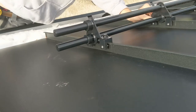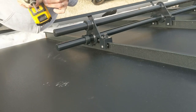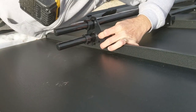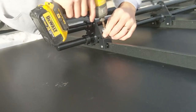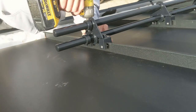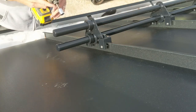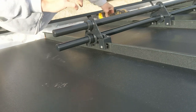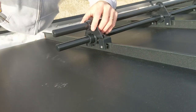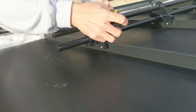On this channel we deal specifically with standing seam, so we're going to give you the best standing seam practices that we know of. Back to the blocks — the block itself is what the company, S5, has actually patented. That's their pride and joy. The block itself has a threaded hole in the top that you can screw snow stops to, screw solar panels to. I've also used them for support wires for supporting long, tall stacks. They're pretty handy things, and again they do not penetrate the roof — always a good thing.